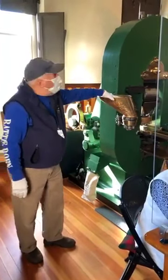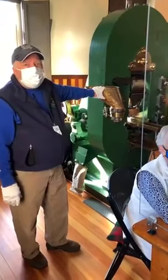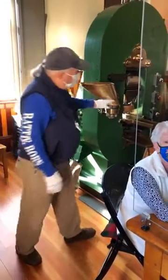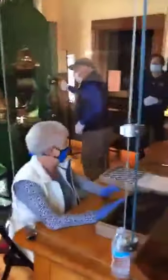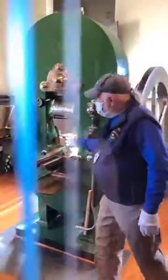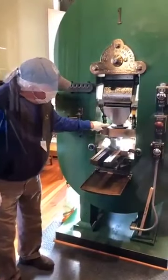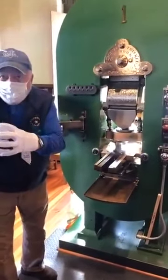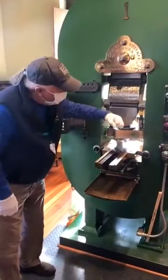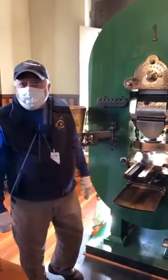And it weighs 12,000 pounds. It's what's called a 110-ton press. The flywheel alone over here weighs 1,000 pounds. This gives the inertia to coin the strike. This is a German-invented knuckle joint press. There's a ball in there about the size of a baseball, solid steel. And when you'll see when it runs, the machine rotates like this, and that causes the pressure that mints the coin.